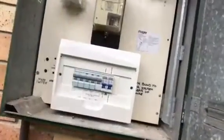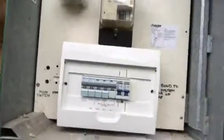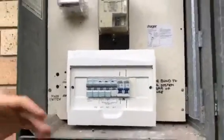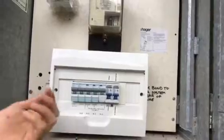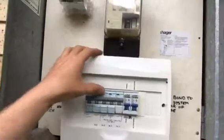Now that we're 100% sure we've unplugged all the appliances on that circuit, we can go back to the switchboard, have a look at the breaker, and see if we can reset it. Alright, the breaker's reset. If it's actually holding on, you've located your fault — it's likely one of those appliances you've unplugged. The best thing you can do now is go back in one by one and plug those appliances back in. The appliance that caused the issue will cause it to trip back out.